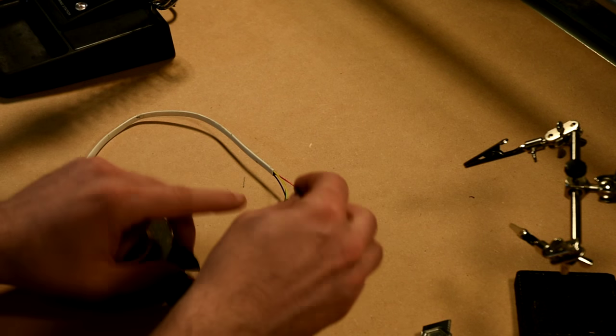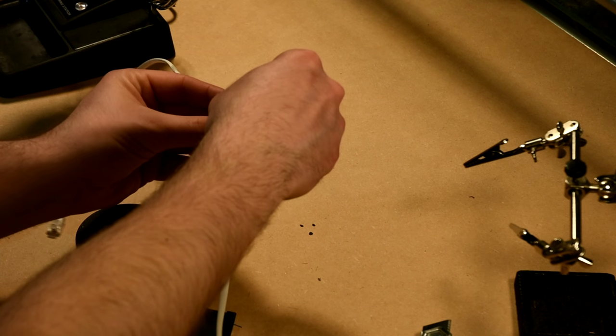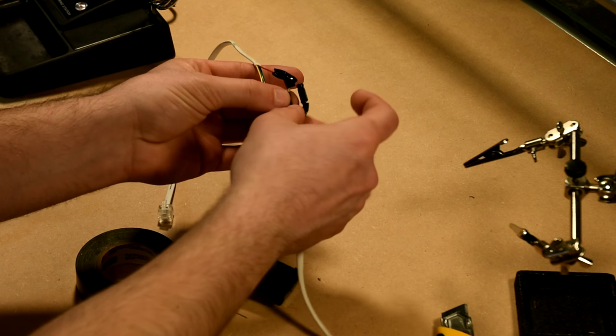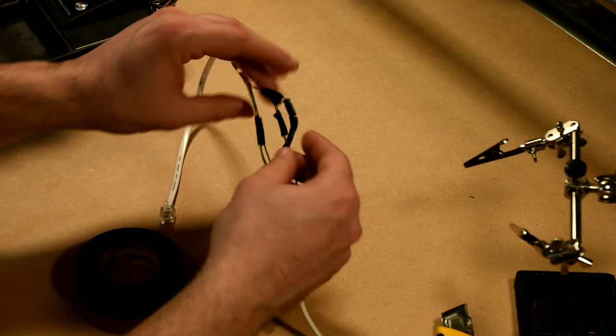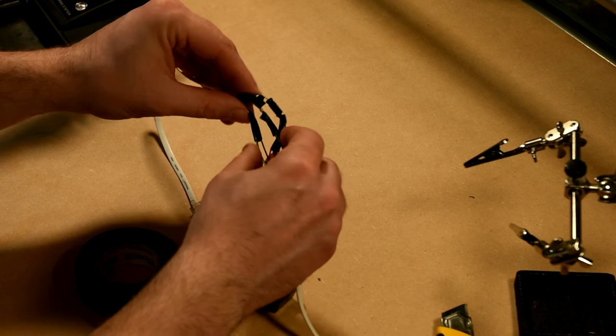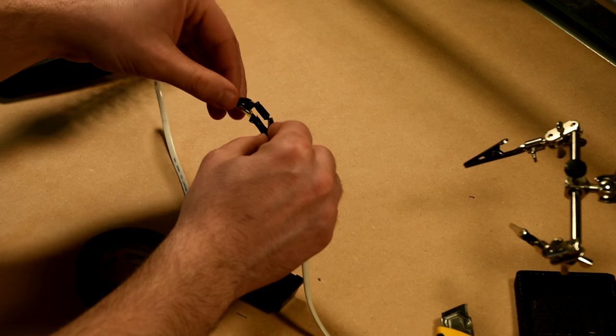You can now enclose the project by applying electrical tape to any of the remaining exposed wires. Ensure that none of the wires are touching each other as you apply the electrical tape. Gently bend the wires together, making sure that none of the connections separate. Try to apply pressure only to the thicker parts of the wire, such as the wire connected to the capacitor.